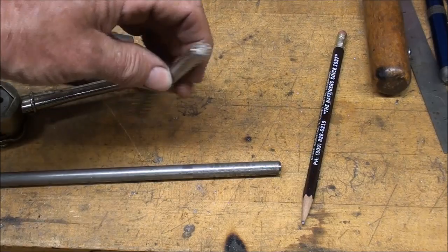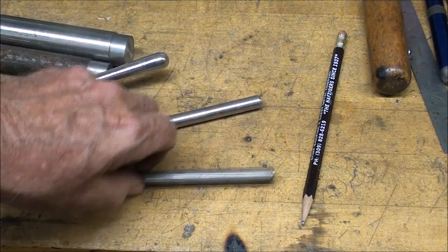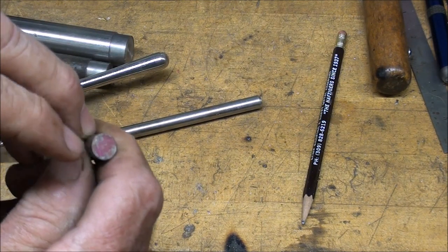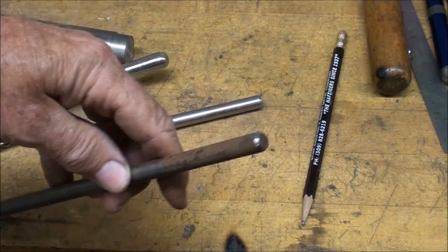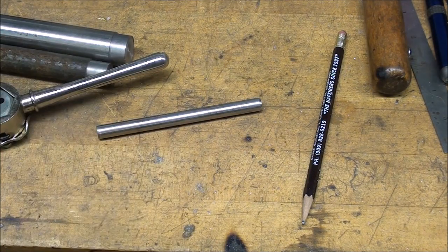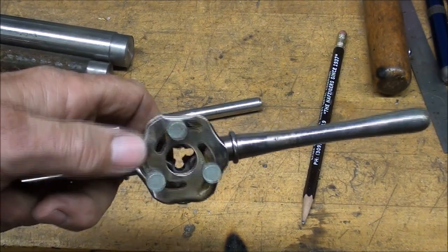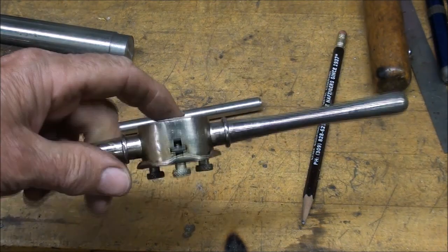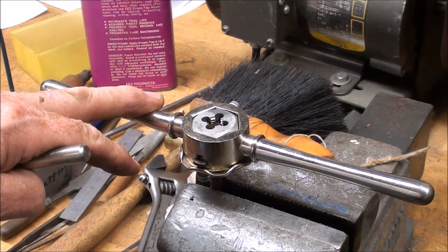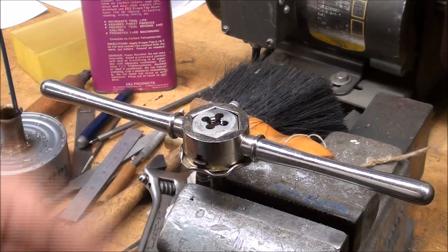Next I've got two pieces of 3/8 rod — this one unknown but I believe it to be cold rolled from my scrap box. This one also came out of the scrap box, a little rust on it, but look what it shows on the end: the purple from Ryerson Steel from many years ago — so that's Ledloy. I'll start with the Ledloy using a 3/8-16 die with a little collet to make sure I've got it on straight, and I am going to use oil. I went ahead and got the thread started, because there's always a little awkwardness getting a thread started on a rod — I did bevel or chamfer one end of each piece.